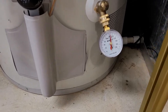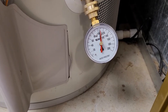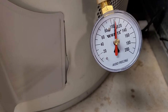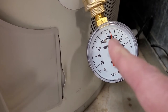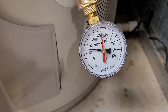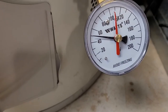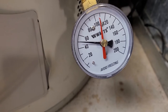The reason you want it down in the 70 to 75 range is because if the pressure gets too high, it will start to damage things like water heaters and pipes, and harm other equipment like dishwashers and washing machines. So it's important to keep that pressure down. It can also develop leaks — partly what alerted us about this — and pressure in showers and faucets was becoming higher and higher. Now, the water pressure will vary if you're using the water; it will drop down. I'll go turn the faucet on and show you what it does. With a faucet running, you can see it's actually down about 50 — it's not supposed to do that.